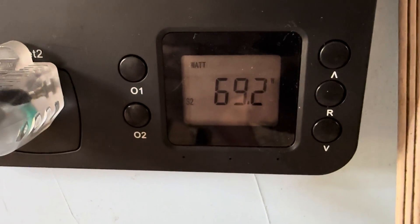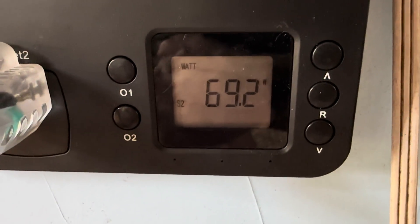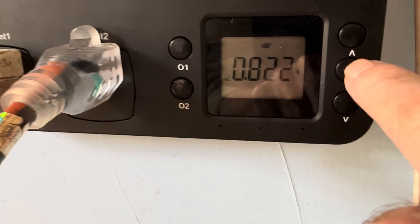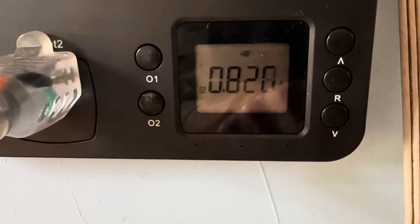There's your freezer drawing 69 watts. These also show amps for those of you that are curious — you can toggle through other values it shows. If you wanted to know how many amps that wattage was, there it is: 0.82 amps. The 100-amp-hour battery I showed you says right on there, do not exceed 1,280 watts. I would never try to push it past that — I wouldn't even try to get close to it. I always try to hold them at no more than about 1,000 watts, but that's just my preference.